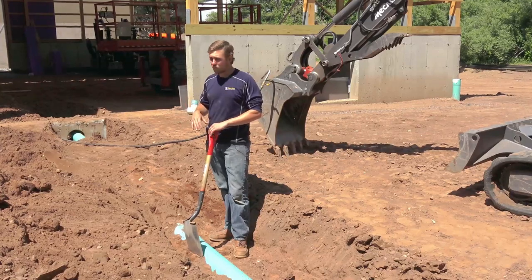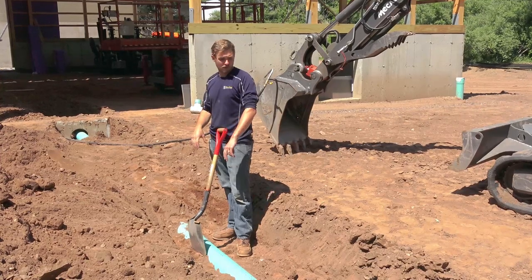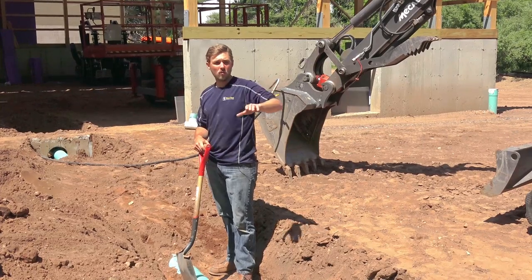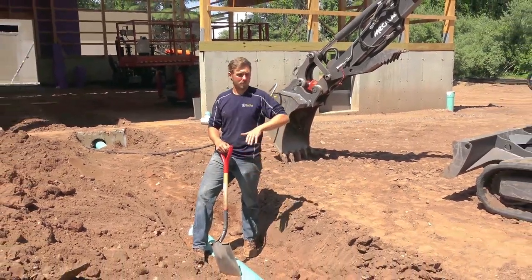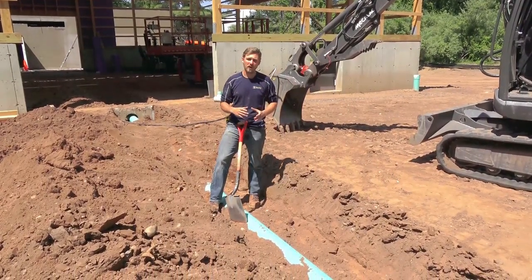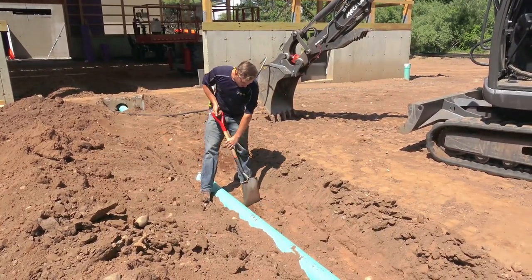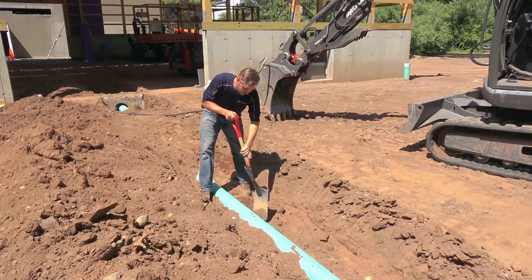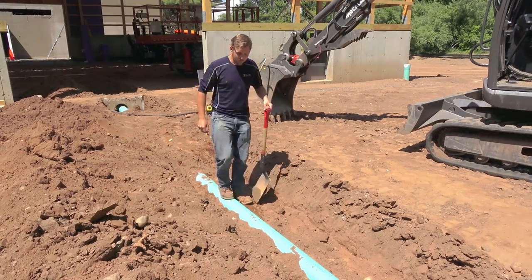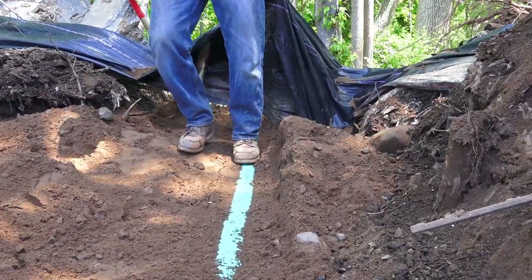Here at PaveTool, we're going to have a concrete pad coming out 20 feet from the building, where compaction around the pipe isn't as crucial. But as we go further this way, we will start to do some paver driveways, and we want to make sure we get proper compaction around the pipe. There are a couple of ways of doing that. One is to take your shovel and jam around the edge of the pipe, making sure there are no voids. The way you know there are no voids is when you stand on your pipe, it's nice and solid and not bouncing. If it's bouncing, there isn't proper compaction underneath.